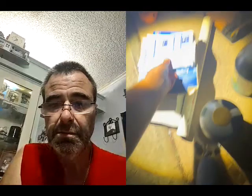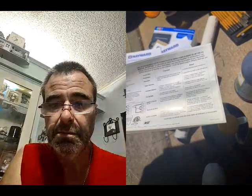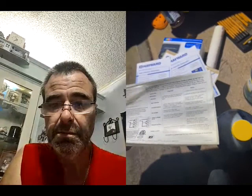I'm going to look at the Hayward paperwork to see if it says anything. Let me ask you this: does the Hayward box work in conjunction with the pool filter? Does it come on at the same time the pool filter does? I think so. It only adds salt to the pool, correct? Once the Hayward box gets powered, all it needs power for is the salt cell. It's not pumping salt into the pool. It controls the salt cell and tells it how much salt it needs to generate into the pool. That's all it does.